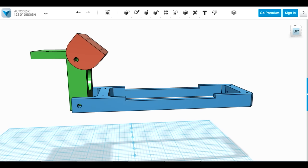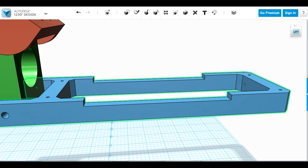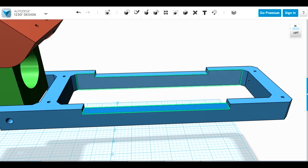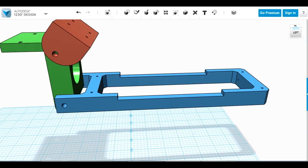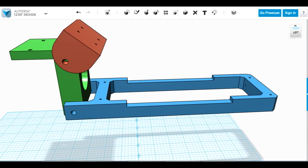But what we need to do is sense any force or load back-driving the joint in either direction. There's a scoop cut out on the blue part in the middle which will allow the coupling to slide up and down. It needs a top on it so it looks more like a slot, and I need to attach the nut to it. That thing is going to slide and be fixed with some elastic — probably printed in NinjaFlex so it's slightly flexible. When we back-drive the joint, we can measure how much it moves in that slot, and that gives us our feedback.